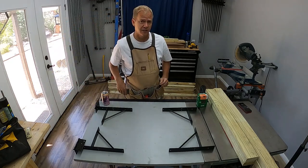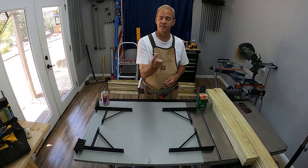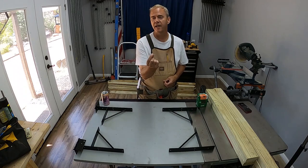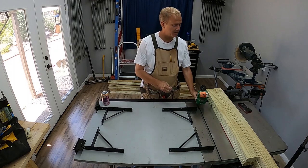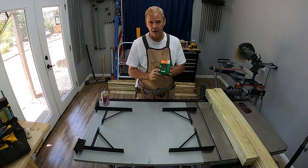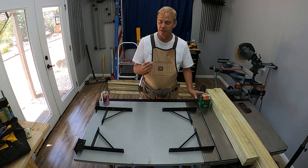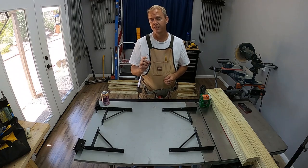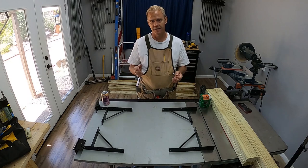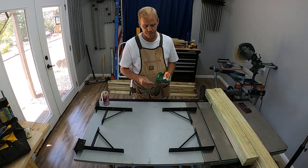I'm not gonna use these. I want something that's a little more substantial, something that has a bigger bite. So I'm gonna use this, a number 10 2-inch deck screw. This is from Spax. They're not a sponsor. I just love these screws because you don't have to make pilot holes before you screw these in, which saves a lot of time. So I'm a big fan of these, and I'm gonna be using these instead.